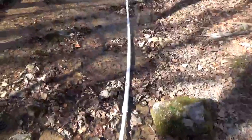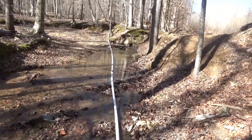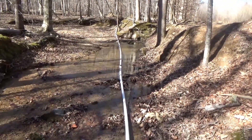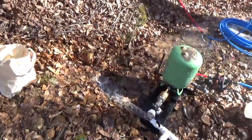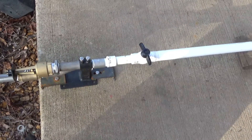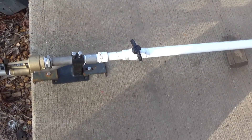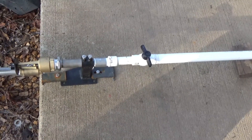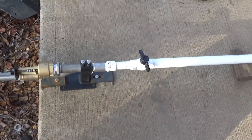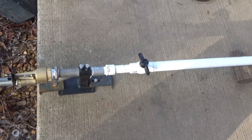Here we put in a two-inch line — about 150 feet so far, we may increase that, but if we do I'll run another video. So we did increase the line length to 170 feet without a standpipe. In the test this didn't work out well — the ram pump cycled too slow. So we'll show you the flow rate of the two-inch pipe and the finished install on the new standpipe.